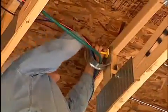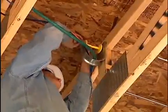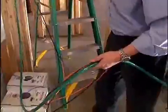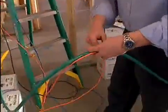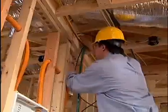After each bundle of cable is pulled, we drop the cables off the pulleys into the J-hook to get ready for the next cable pull. When the cables are pulled, Rich takes the labels from the boxes or spools and applies them to the cable, then cuts the cable with a little extra slack. He then passes them through the feed holes.